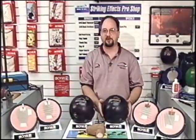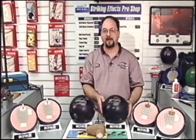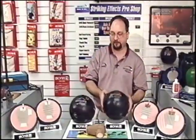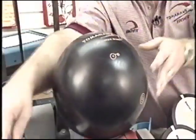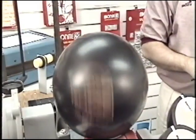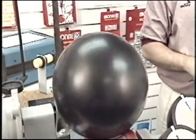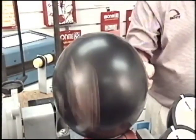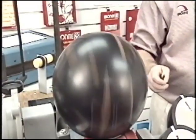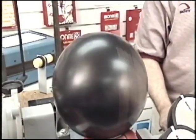We're going to repeat this procedure for the Tomahawk low torque, expecting to find the preferred spin axis to be 90 degrees from both the pin and the bomb, or the mass bias. And the mass bias amount in the low torque ball is roughly 25% of that in the high torque. You can see it takes the low torque a little longer to find its preferred spin axis.